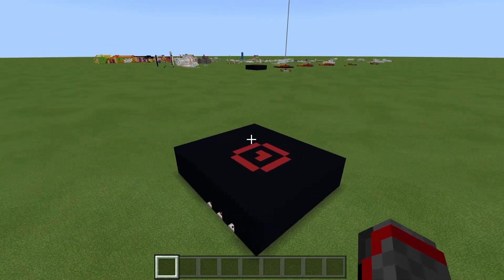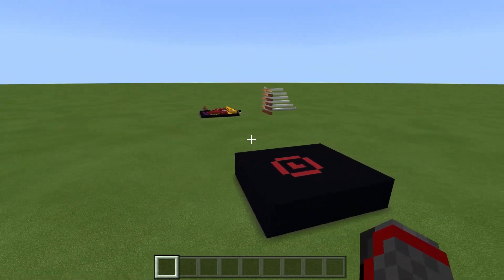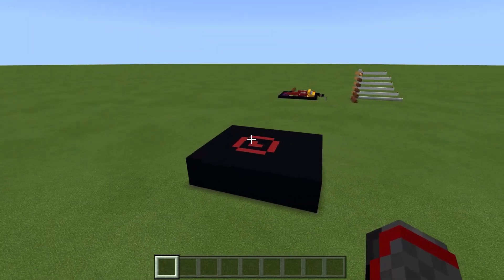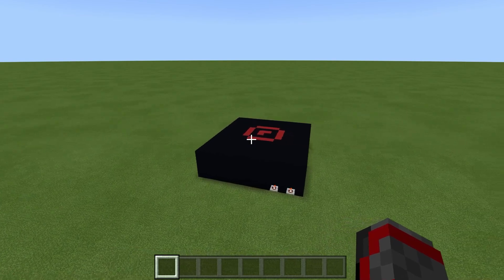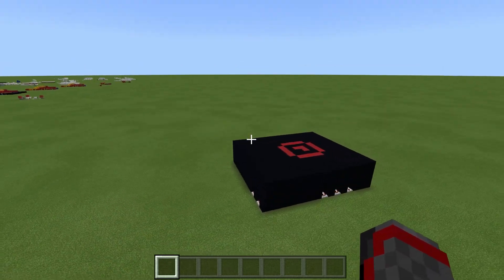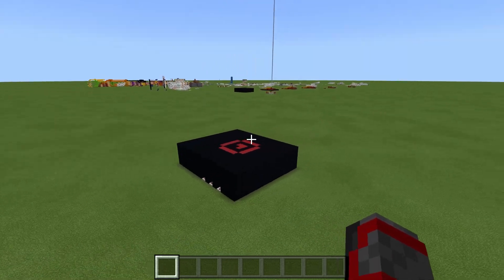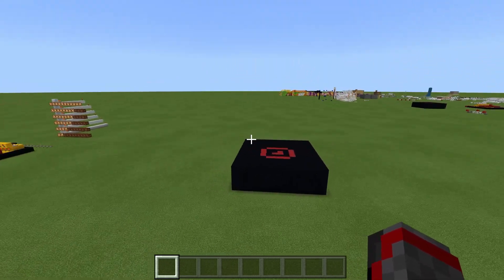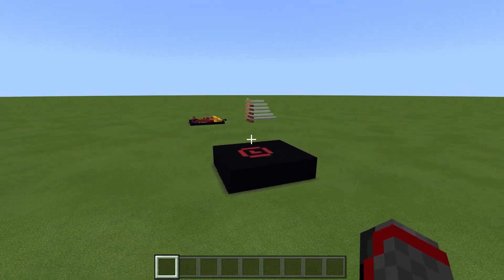This computer is the equivalent of a 4-bit computer, so it can deal with numbers from 0 to 15. The only difference from this and other 4-bit computers is that this is based on hexadecimal logic instead of binary logic. It has two ports, which you can use to improve this machine without having to completely start from scratch. It has six functions, including NOT and ADDING. It has three registers — two for calculations, and a third for the result of the calculations.